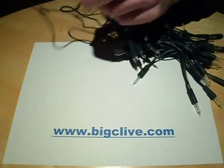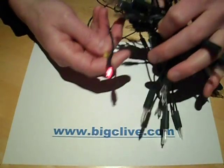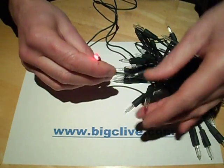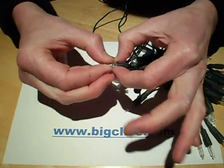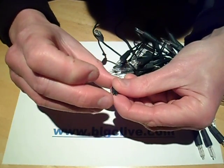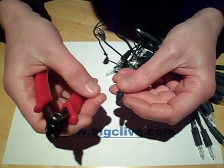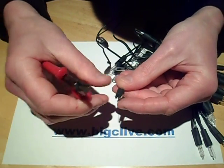Let me show you this lit and how to modify it. The red LED has lit, but none of the other lights have because the current is limited to the whole circuit and each LED only gets a few milliamps — not enough to light the tungsten lamps. So I'm pulling one out, removing the lamp from its holder — some sets have them glued in, but not this one. I'm threading an LED in where the lamp was, folding the leads over the back, and cropping them short. You can't leave them sticking up too far beyond the main body of the lamp holder, as it makes it difficult to insert and tends to jam.